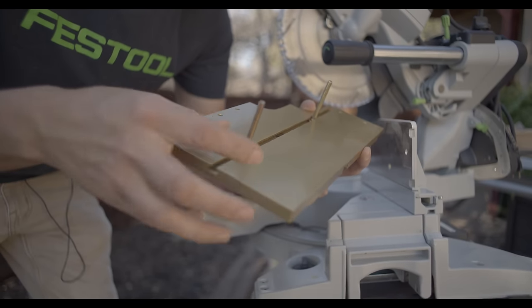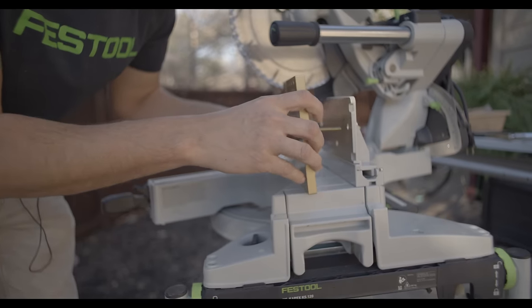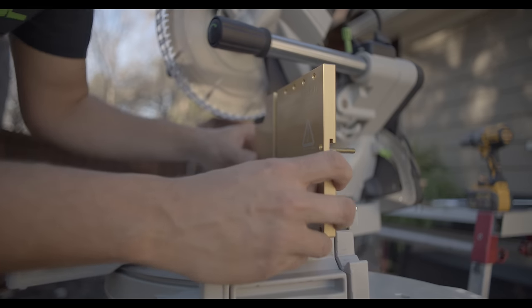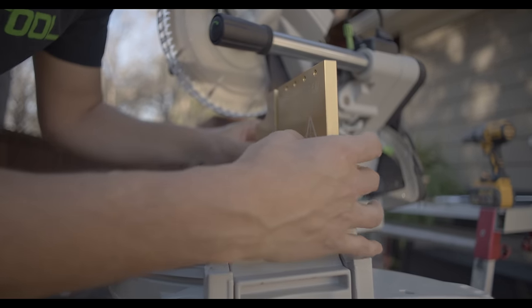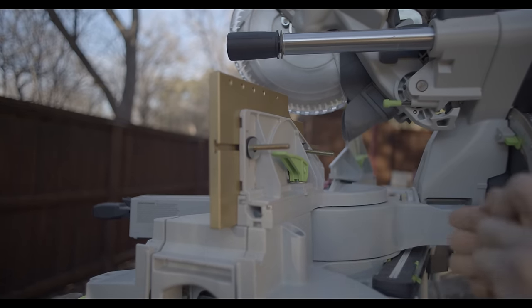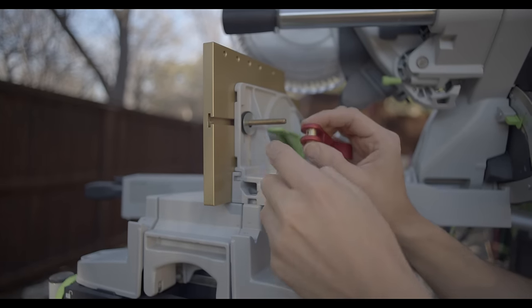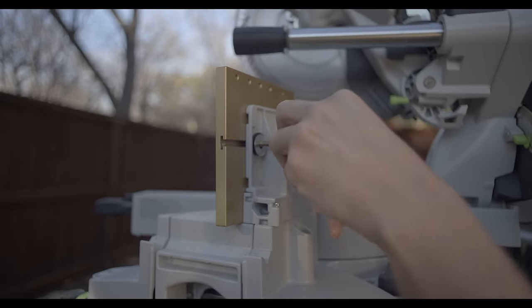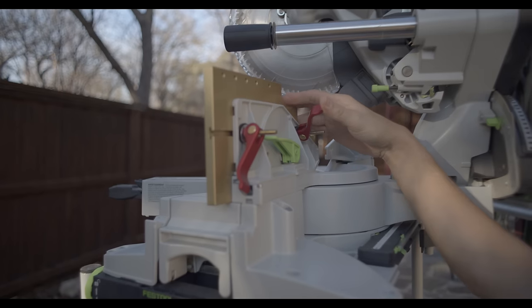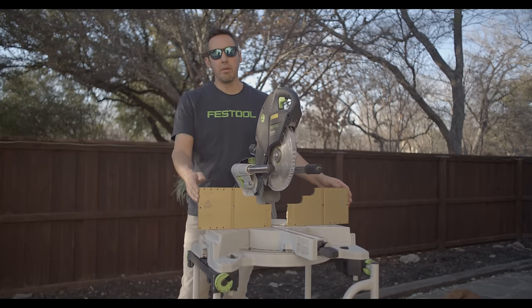With our holes drilled, in the kit you get this little T-track bolt that slides into the back of the fence — this is how it attaches. I'll get those in position; they're not going to fall out. Then it's a matter of lining those up with the holes that I drilled. Now our fence is in position, we can get our cam clamps on the back. We put the soft black washer on first, then our typical washer, then our cam clamp. These thread onto that bolt and once you get them snug you push the clamp feature down and that holds them tight.